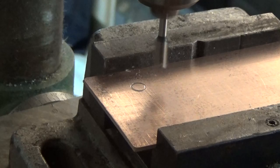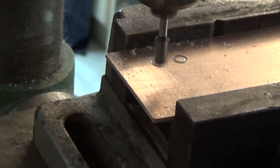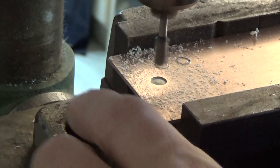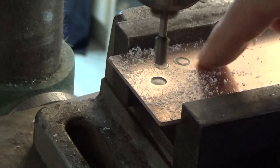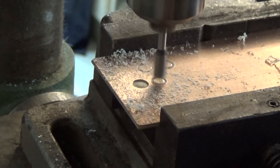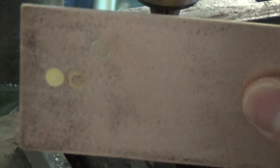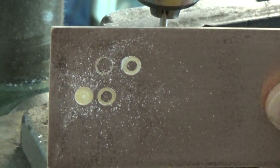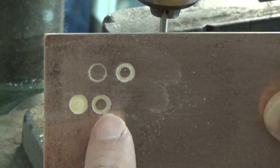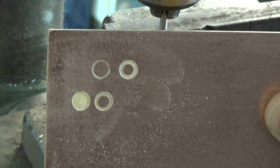You see, that is all you need to do. The only thing is you need to be really careful, because if you are too rough you can go through the board and completely destroy the copper. What you need is a little island, so the only thing you need to do is do it carefully. Depending on how much force you put onto the tool, you get your island — but as you can see, it is really, really simple.